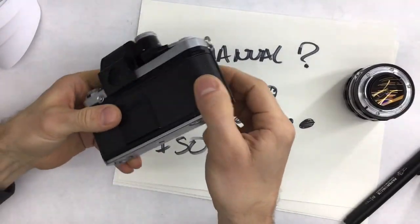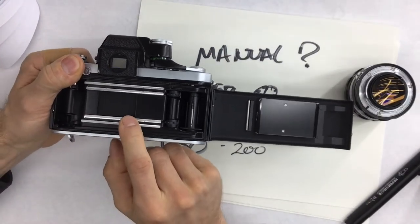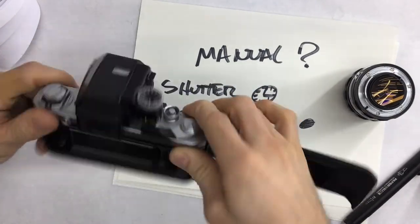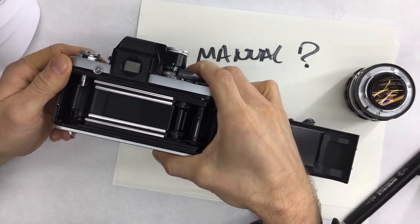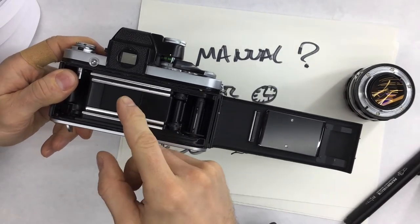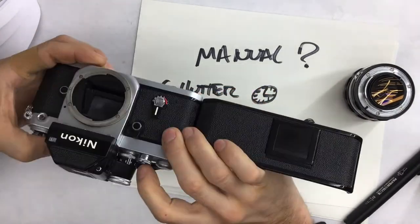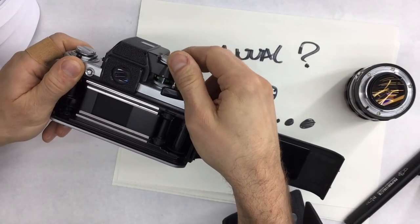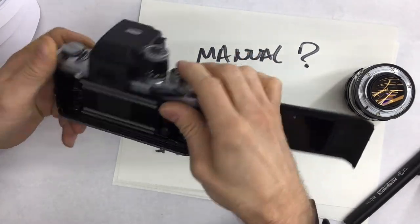Shutter speeds are a little more difficult to show, but I'll open up the back of this camera. What you see when you look at the back is the shutter curtains, and what you see from the front is the reflex mirror. If I load the shutter at about 1/1000 of a second, you can barely even register that on video — you'll see the shutter curtains opening and the reflex mirror snapping out of the way very quickly. Now if I really slow that shutter speed down from 1/1000 to 1/30th of a second, it should be a little easier to see what's going on.